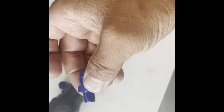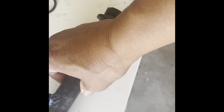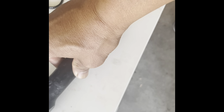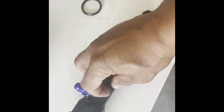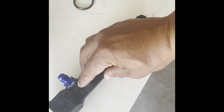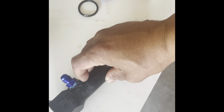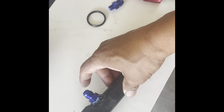I used a drill bit to drill the hole a little smaller than this, and then I used my knife to make it bigger little by little. I was testing it with my hand — once I felt a little resistance I used a combination wrench to get it in there. Again, if you over-thread it or break it or the hole's bigger than what you intended, it shouldn't have a lot of pressure — it's just basically going to pour the oil back in here. I'll show you with it running so you can see the oil just pouring in. Even if your hole is bigger, JB Weld would hold. I'm still going to take measurements and make sure the hose is secured somewhere over here so it never pops out.